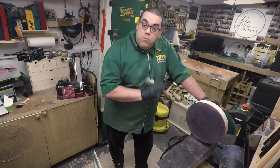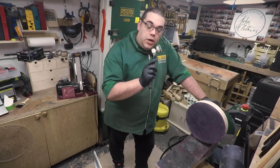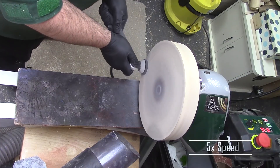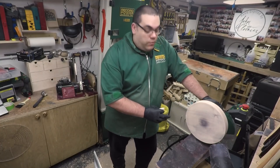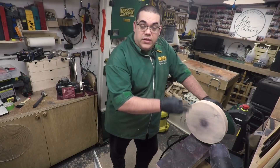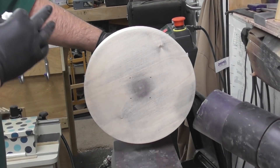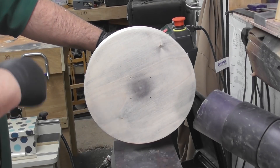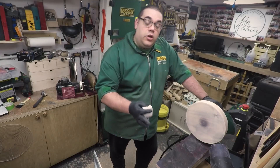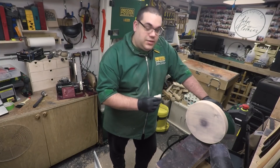Okay so that's dry. Now all we want to do is remove a lot of it and we're going to do that with sanding. If you sanded up to 400 grit, go back to your 400 grit and just sand it again. As you can see most of the black has gone but it's left behind in a fairly random way. Areas where the grain has absorbed more of the black are creating pattern. If you find it's not coming off quickly enough, you can go back up through the grits — say to 240 — but you must come all the way back down to 400. Now I'm going to give it a quick clean and then we'll put the blue on — exactly the same blue as before, exactly the same method.